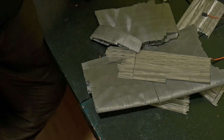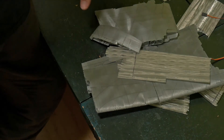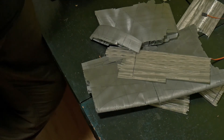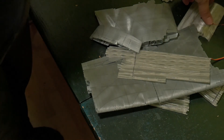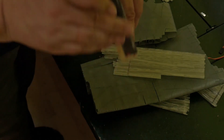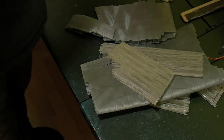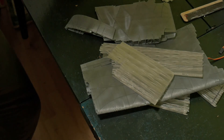Don't worry — Cyanoacrylate glue holds PLA parts well enough. You must just clean the rest of glue from the hotbed if you use glue on the hotbed. If you're not sure about the adhesivity and bondability of parts before gluing, you can use sandpaper to make the surface a little more glueable, clean it of dust, and then apply the glue. So that's the small destroy test — thank you for watching and have a nice day.